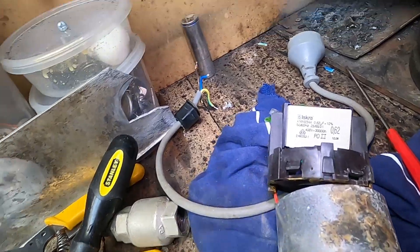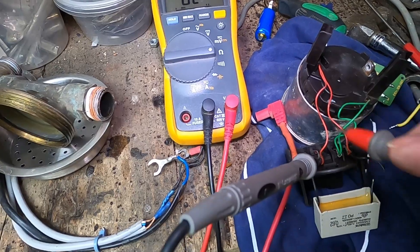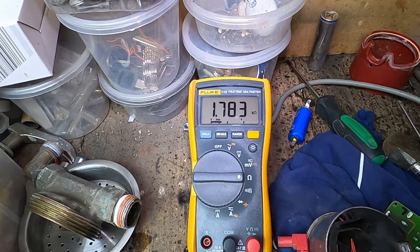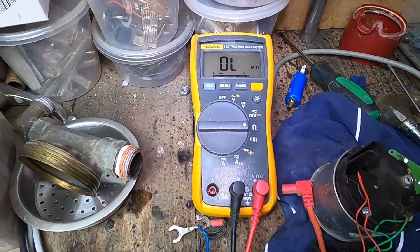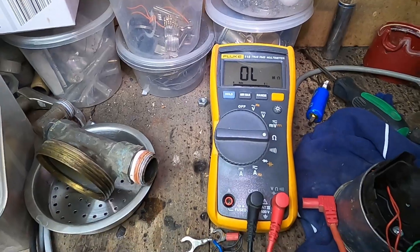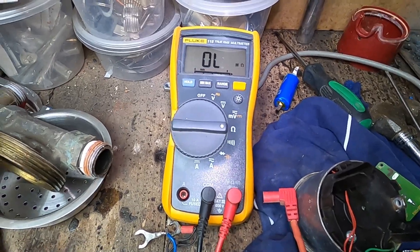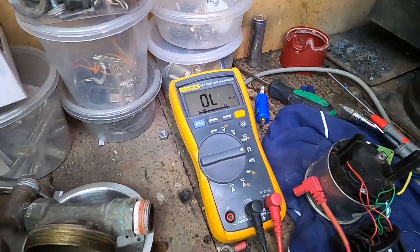Making a little bit of progress here. From the red wire to the other red wire - both circuits together - that's 1.7 kilohms. Red wire to the green wire: 893 ohms. The other red wire to the green wire: 893 and 891 ohms. The coil resistance is pretty consistent and seems to be holding.